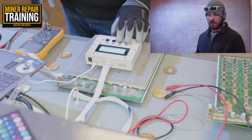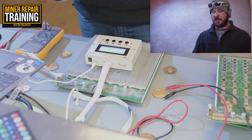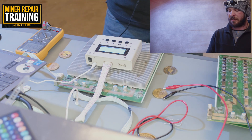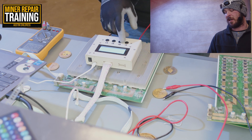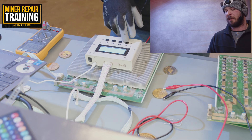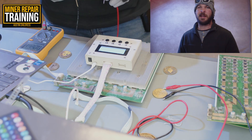Now you can adjust the voltage that you want it to read out of your power supply, and actually test it with your multimeter on DC voltage to see if it actually goes to that voltage or is around that voltage. As you adjust it, you can see the voltage either going up or down towards that target, and that will determine if your power supply is actually good.